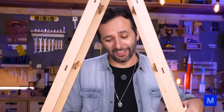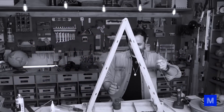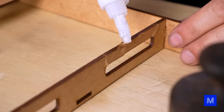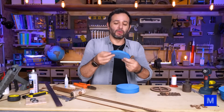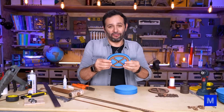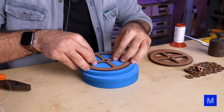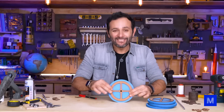Let's do an exaggerated test — this little weight is one kilogram. It fell onto the MDF and broke it — oops. But it can handle the weight; you just can't drop it straight onto the cart. The wheels will be made of EVA, but since that's a soft material, I added an outer layer made of MDF. So it's like having an EVA tire with an MDF wheel. Super glue works great on both materials, and both also cut well with the laser. The result is very sturdy.